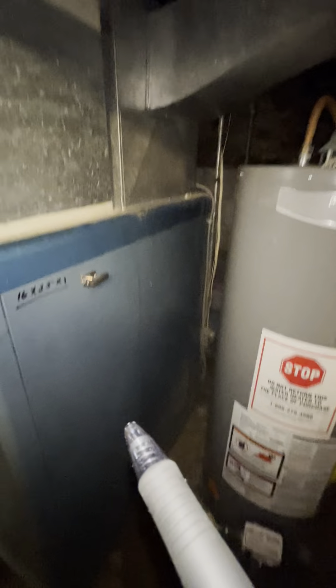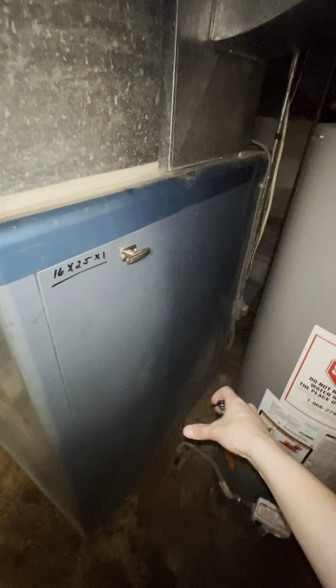What we want to do is a furnace and air conditioning coil up top, and then we're going to need to run that coil and line set all the way out through here. We can either go out through the back, which I'll show you a little bit later, or we can go out through the front right up here — either way is fine. We haven't officially decided; we'll take a look outside and pick where they'd like to put the unit if they decide to go with air conditioning.